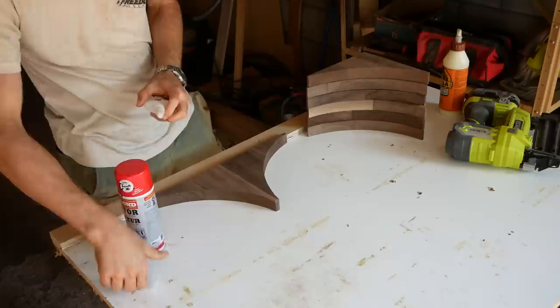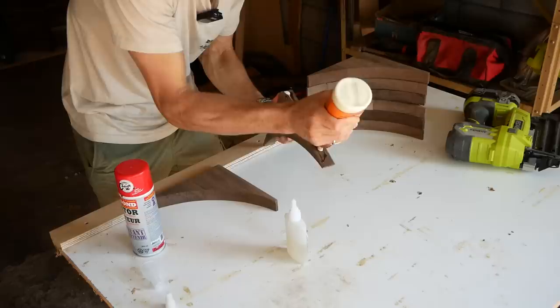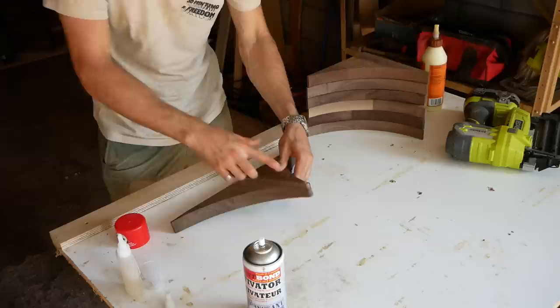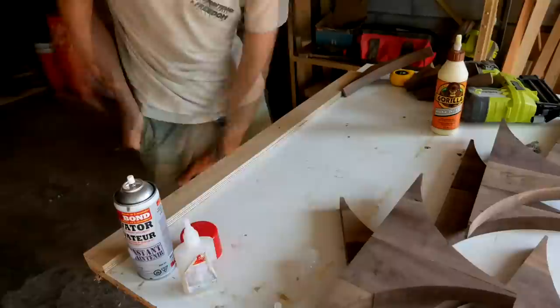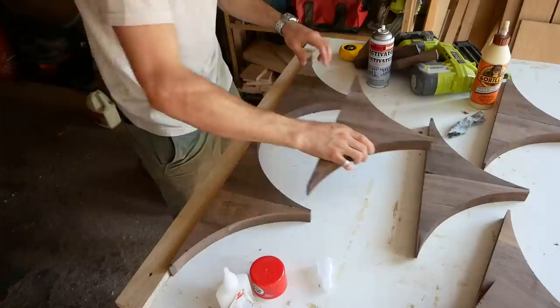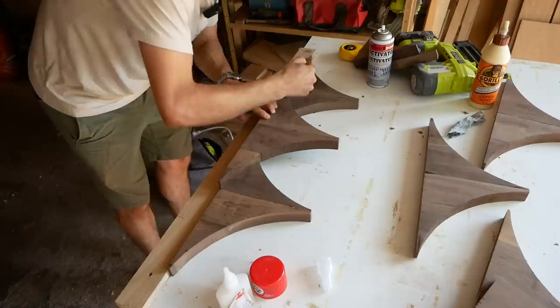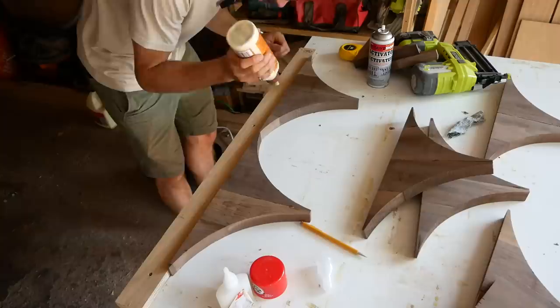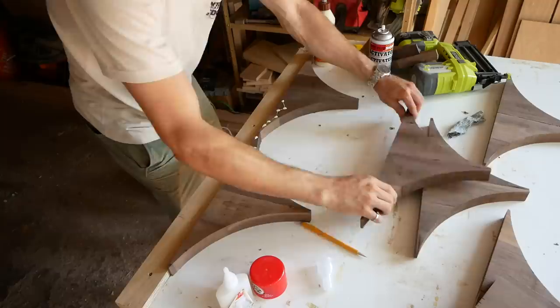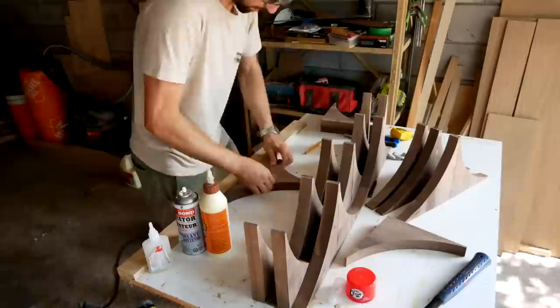I screwed down this flat piece of plywood to use as a fence and then just to get started, I'm going to use some super glue and wood glue — but don't worry, we're going to use some stronger fasteners for the other ones. I'm not using too much wood glue because I don't want to deal with all the squeeze out. I'll take two of these shapes, put them against my fence, and then this one goes right in the middle. I want to be really careful to only put glue inside this outline. Put this on top, line up the edges, and just drive some brad nails. And there is the start of our pattern.